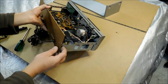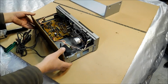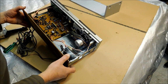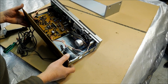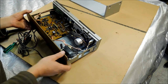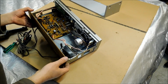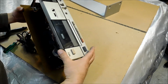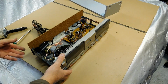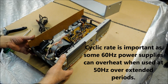A lot of hi-fi gear that you can get now on eBay and so forth, you get overseas through ex-United States. And it really does appear that there's a lot of better quality equipment there than there was offered here. At least it doesn't come up for sale so much. So I'm thinking about getting ex-US stuff. And of course you can use a step-down transformer. They're readily available, and we'll talk about those as well, to power them, so you don't have to get stuck with 110 volts. Although I think it's 60 hertz there, where here it is 50. So we need to consider that as well.